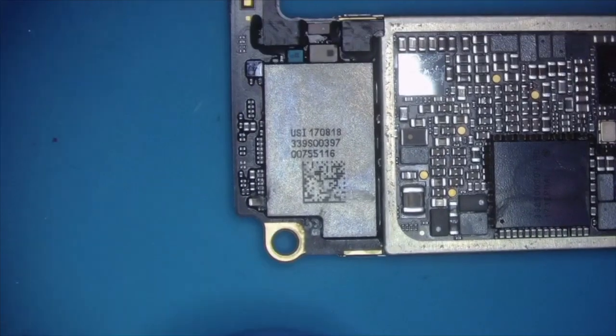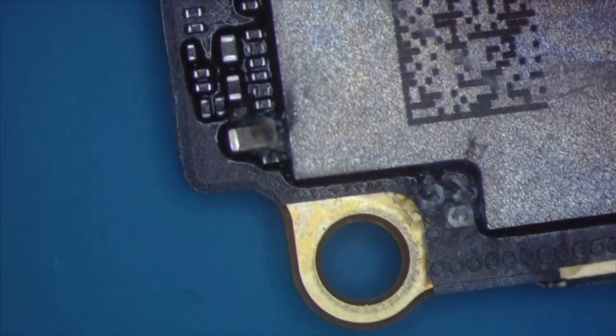And let's go ahead and see the damage on this board. Now, I did tell the gentleman if it's just a main short or a cap, I could just pop it off for him and call it a repair without warranty. And then I looked at the board and saw this. So let's go ahead and get started. You'll see here a main cap that is short, another main cap that is short.